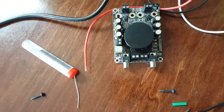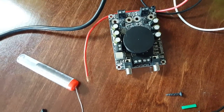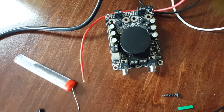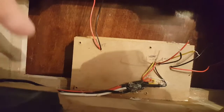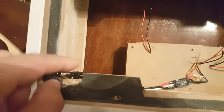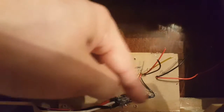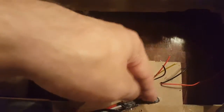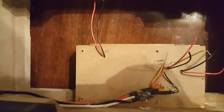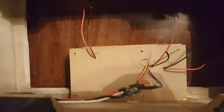If so, I'll show you how I wired that. And that's it for now — here in a second I'll mount the board and show you what everything looks like inside. Okay guys, I just wanted to show you: that's the 3.5 millimeter jack. You can see I ran the black to the black, the yellow to the white, and the red to the red. And I just ran some hot glue down there, and I'm going to run it underneath so no one really sees it.